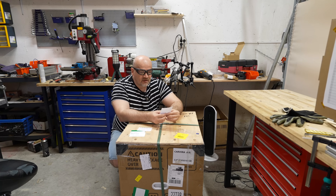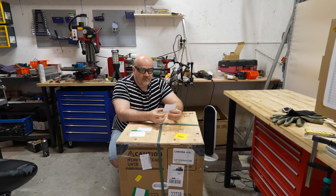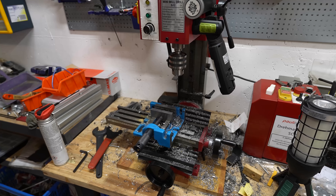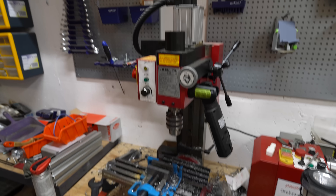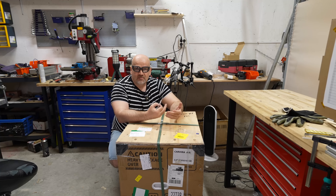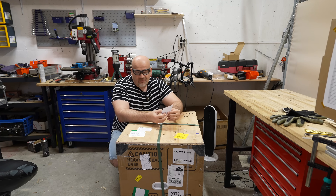Now the spindle: 13,000 RPM and 200 watts. Unfortunately, this may be the weakest point for me if I want to engrave metal, because for example on my manual machine it is 500 watts with a brushless motor and gear ratio giving much bigger torque on cutting. But basically this should be good enough for softer materials, and probably even for aluminum.